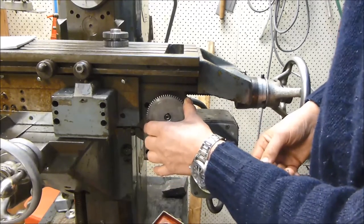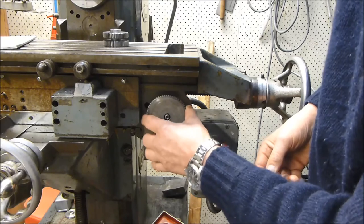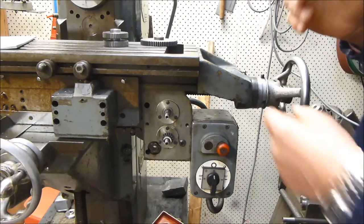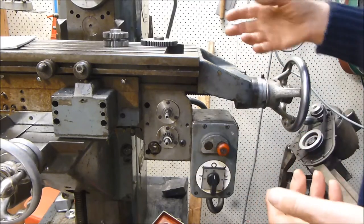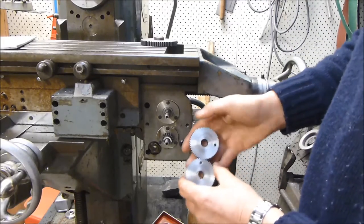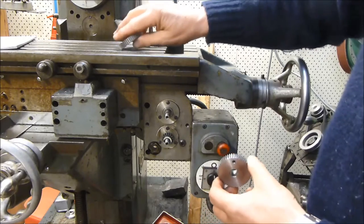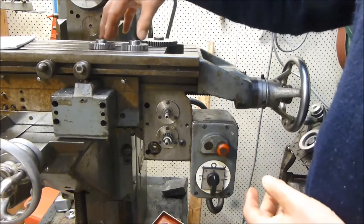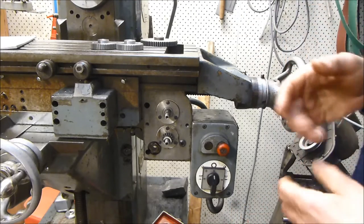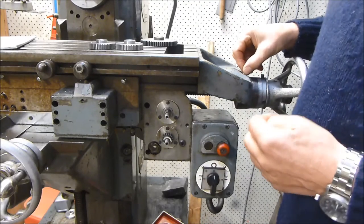According to the book, the mill was supplied with several sets of change wheels. The previous owners have lost those, so I've decided to make some new gears. I've made these two 52-tooth gears, and the manufacture of those on this mill is the subject of my next video. I've made the gears, shot those videos, and at this point I'm about to start the editing and publishing.